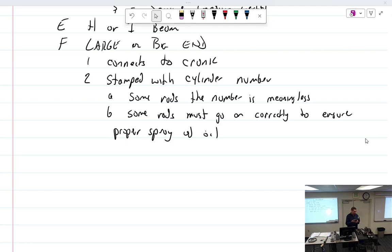You can't just call up and say I need a cap — they're a match set. There's an inspection where you clean the rod with Scotchbrite, use a magnifying glass, and you're looking for any tiny little pits. If you look at that service instruction — it's in the book, 11-something — it's a really critical inspection. Even the smallest little dot that doesn't clean up is cause for rejection. There are companies that will trim them, bolt it together, reline bore it, and they can do that with proper approval regardless of what Lycoming says.